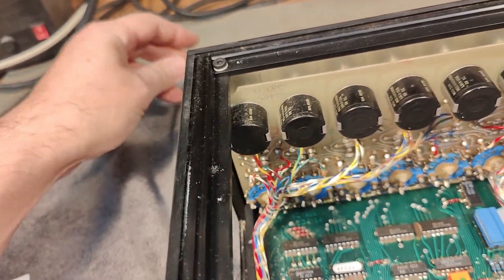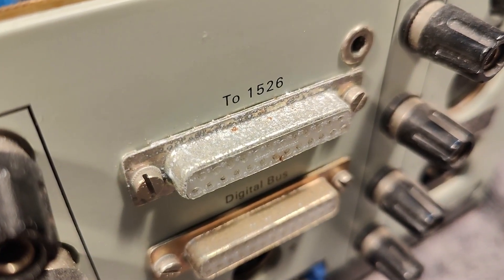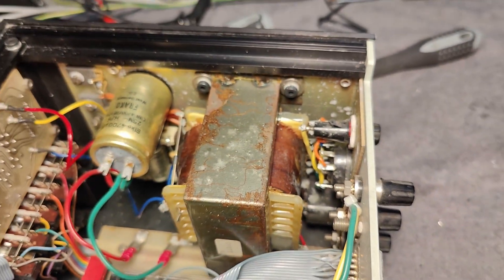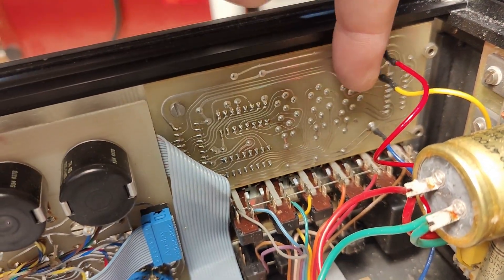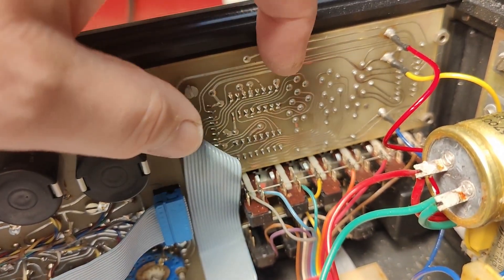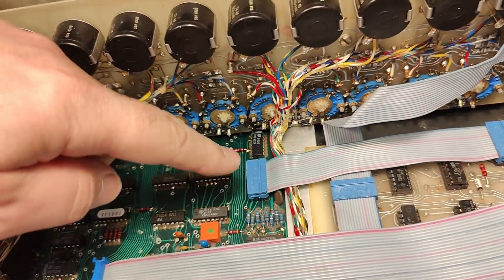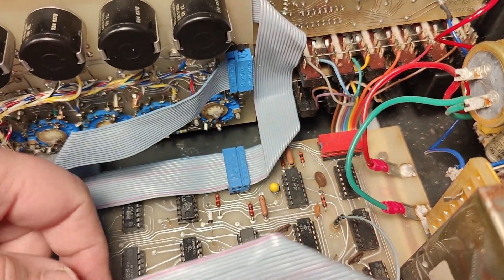That is not how it's supposed to be fixed. The state of this unit is a little bit sad — you can see corrosion on this connector part, and also everywhere on the inside. We can see really really bad corrosion — oh my god. And that will be a Beckman display: a three-digit Beckman with a little high-voltage counter driver, and it goes to seven-segment decoding and then some more stuff related to the display. So maybe it can read out something.